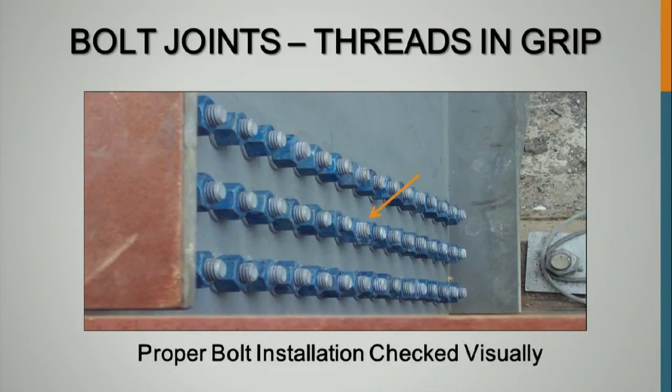And you look for anything out of the ordinary. That bolt we got the arrow by looks like the stick out is a little bit more than the rest. These had DTIs on the backside under the bolt head. Was the DTI left off here? What happened? Why does that bolt look longer than the rest of them? It looks like it's missing about 1/8 of an inch, or 1/8 inch longer. Why is it different than the rest?